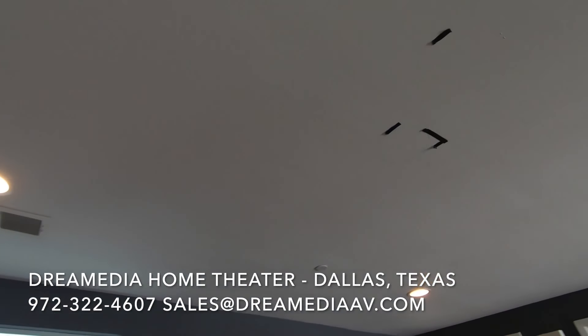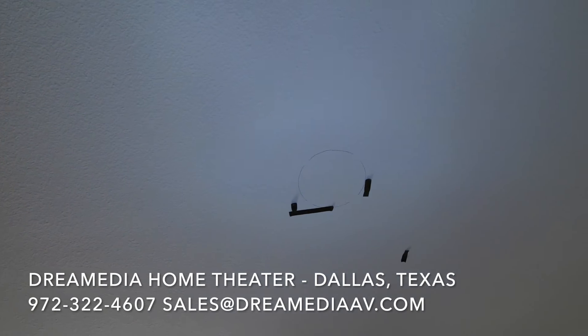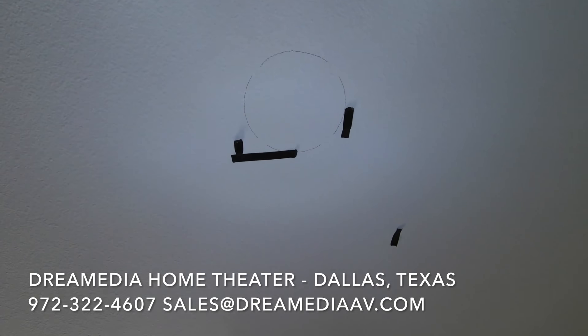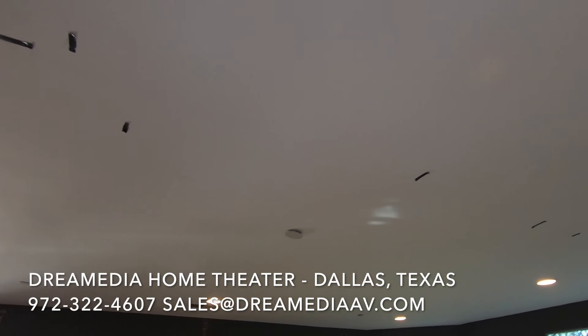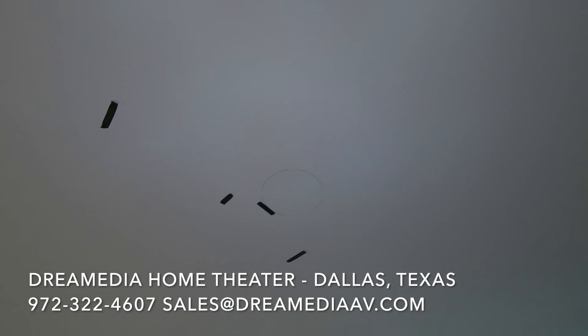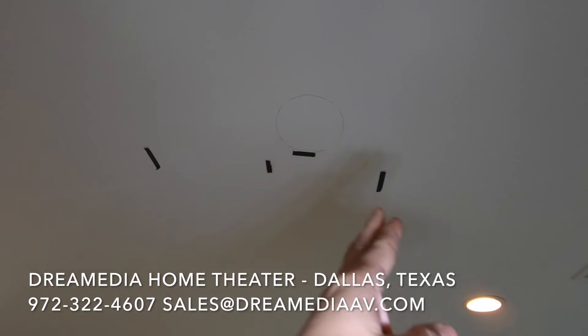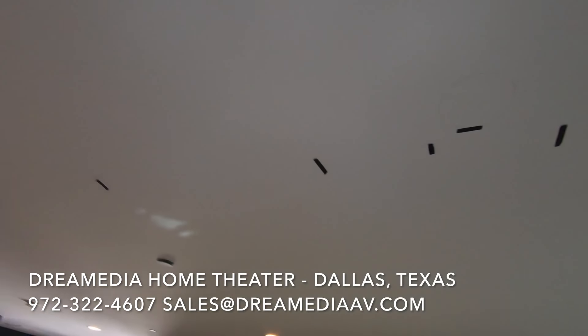I just got our Atmos traced out, which was also difficult because the framing wasn't really cooperating. You can see I have this one at 60 to 61 inches exactly off center — this is the center of the room, which is where our projector is going to go. And here's our other Atmos speaker. I was marking out the studs so that we don't have any framing issues when we go to cut these in.